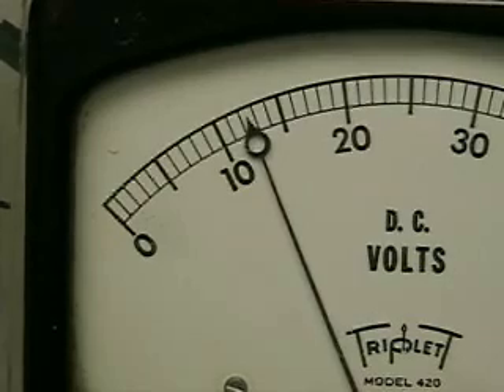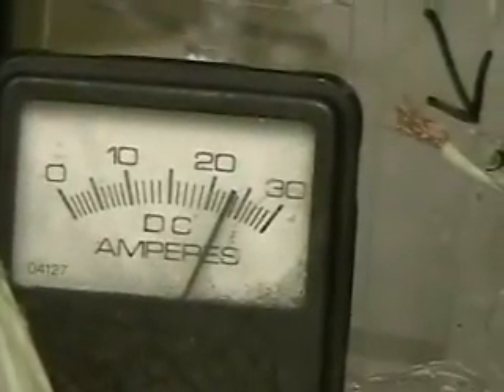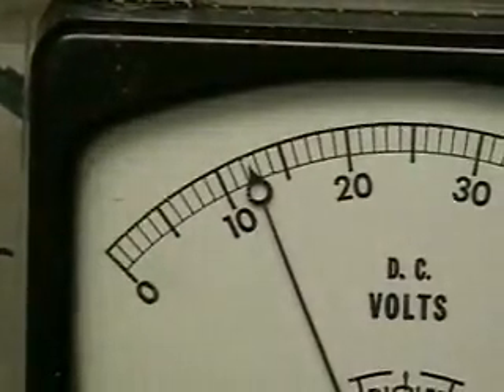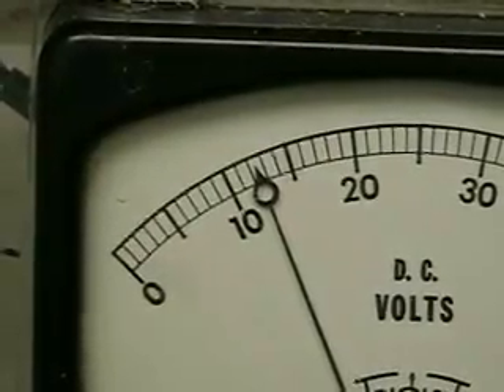The Series 3L is geared for upgrades. There's a half inch port on the top for the gas that we're using right now — it's actually a T which gives you two half inch ports. Most other units would be running a quarter inch pipe coming from the hydrogen unit, but this is a half inch. You certainly can put a plug in there and run it at a quarter inch. The Series 3L also has a water input port on the top and a connection port to another Series 3L on the bottom.